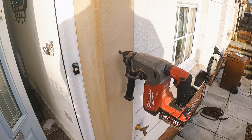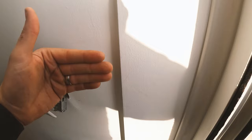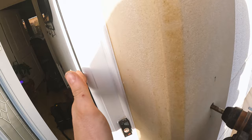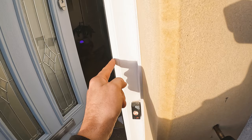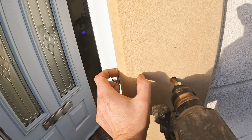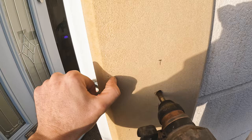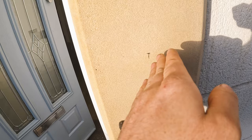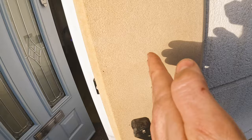We've got the perfect angle then. When you're figuring out these angles, you've got to figure out how far back, figure out where this wall is here. We measured out - you add these steps up, add that little lip up, and then you've gone this way. It comes up 100mm or 10cm and you work back this way. Whatever this distance is, you minus off that, and then you're left with 40mm. So that must have been 60mm. 40mm landed us here. And then we got the depth of the actual wall which was 80mm. So from that 40mm, we knew that's the front of the wall and the depth is here. So we had to slightly drill here on a slight angle which over this distance will pop you out in the middle of the wall. That's how you figure out how to angle a drill.